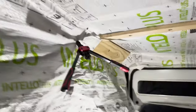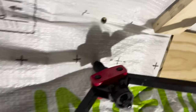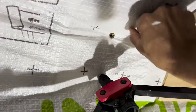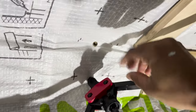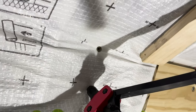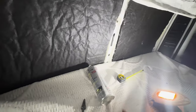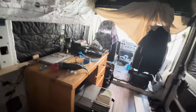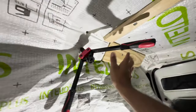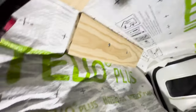So we're working on these upper furring strips. I do remember Moser Makes mentioning this when he used the Intello Plus. The only reason I'm afraid to do it this way is because if I have to move it — if it's too tight or I need to run wires — I'll have to take this off completely. It is a lot faster doing it this way though. The entire process is: use a step bit to drill a hole through the metal, paint it to prevent rusting, poke a hole through the Intello Plus, install the rivet nut to secure it down, measure and cut the board to size, use butyl tape to stick it onto the wood, press it up to find the rivet nut location, drill holes through the furring strip, use the countersink bit to recess the bolt head, then place the furring strip up, bolt it down, and start the next one.